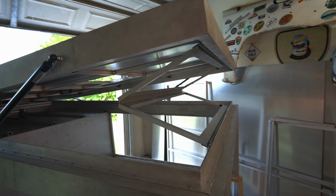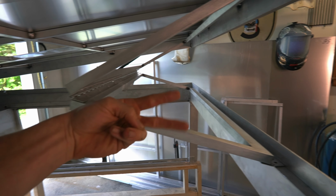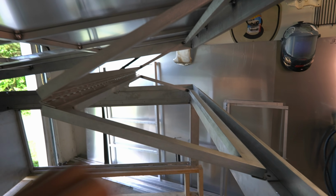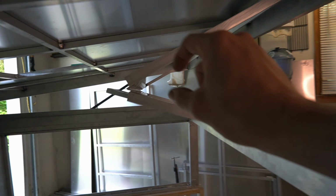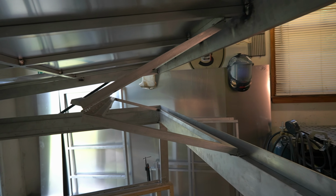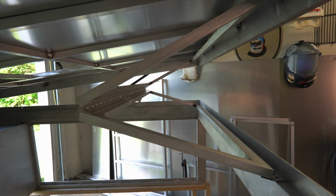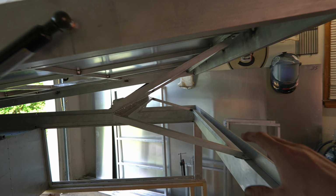Here we are in a partially open position. I just want to show you guys a better explanation of why I went to these hinges. As we're closing the camper, we're going to have fabric that's going to want to go somewhere. With our old style hinge, these 2 bars would start creating kind of a scissor action, so the fabric would have to fold in between them and probably end up wearing out over time. Because our new hinge folds more like a book, we now have probably a little over a 1/4 inch gap for the fabric to lay in. Obviously our fabric's not very thick, so that'll be plenty of space for the fabric to tuck in here, and there's nothing for it to get worn out on, no sharp edges or hard pressure points that the fabric is going to have to deal with.